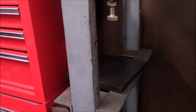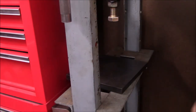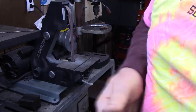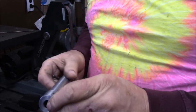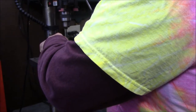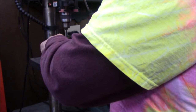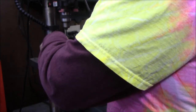That's the best $60 I ever spent, folks. I'm going to press it — let me get you up here. Now all I've got to do is machine this off. We're good to go. Here's the completed repair. Now all I've got to do is drill it. I'm just going to take the drill press, line it up on the two holes, and go through here and re-thread it off camera. I'll line it up right here in a V-block and just drill these holes right out — right to the bushing. When I get done tapping I may have to go in there, take the reamer, run it in once I get done tapping and knock the burrs out of it.